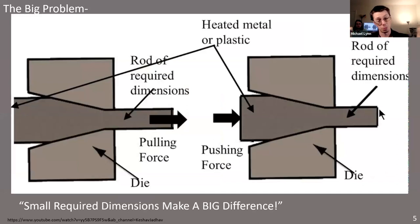The big problem with the big systems is that they operate on a fundamentally different set of assumptions. The basic physics are very similar, but because they're so large, they take advantage mostly of heat generated by plastic deformation. If you've ever bent a paperclip back and forth until it breaks and felt it get hot, you know that bending a metal or other hard material generates significant heat as the bonds in the bulk structure break and reform. In bulk extrusion, people take advantage of this effect to reduce the overall force required to push a rod or billet through a constriction — a die.